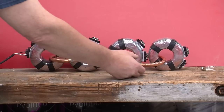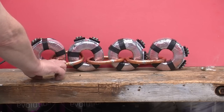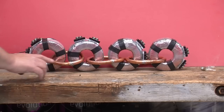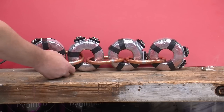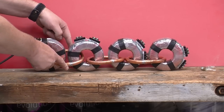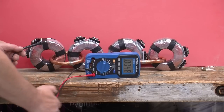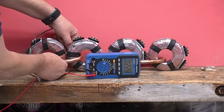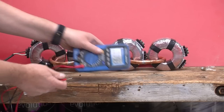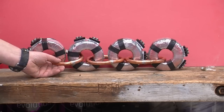That's a lot of current, but we're not actually drawing any significant amount of power. So what's special about this current? Well, this current is at 90 degrees compared to the voltage on these incoming wires, and similarly it is at 90 degrees compared to the voltage across the copper coils. What do you think that voltage might be? Well, that voltage is about 1/500th of the line voltage. And if we hook up our trusty meter to it, we see about 0.22 volts, and that is indeed the voltage being imparted on each one of those copper toroids.